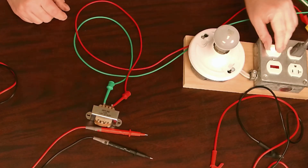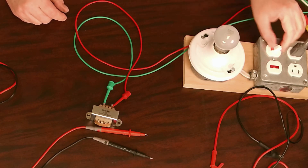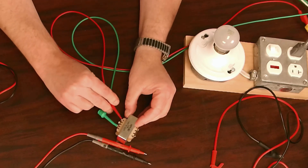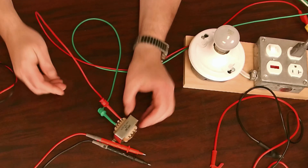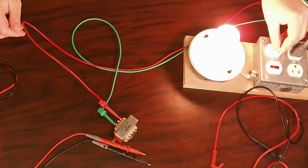I'm going to attach it to the primary first. I have a 40-watt light bulb in here, and I'm going to turn it on. And absolutely nothing. So that would indicate that that is most likely the primary, or some other high-voltage winding — certainly a winding wound for at least 120 volts, or 240 volts if you're in Europe. Now I'll attach it to the secondary — I'm going to use the 12-volt secondary. It's a center-tapped winding, so we'll go end-to-end. And if Robert is right, the light should light up. And it did.